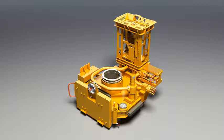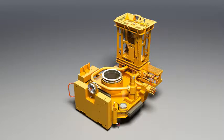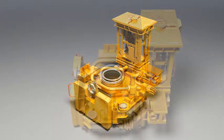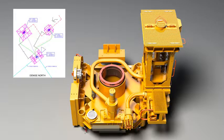As the dummy RPM adds weight to one side of the flow base, extra counterbalance weights are added to the other. The RPM impact cover is then installed above the dummy RPM, ready for deployment. At this point, the latch cam assembly in the centering can be adjusted so that the flow base lands off on the wellhead in the correct orientation shown on the field layout.